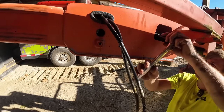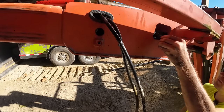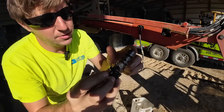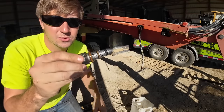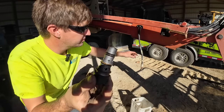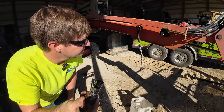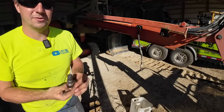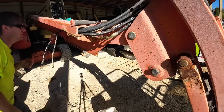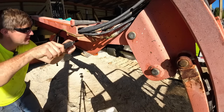Oh. Come loose, or is it something came loose? There we go. I was worried it was gonna be a whole bunch of different components on that check valve that was gonna drop and lose in the gravel, but that's what we got. As soon as we took it off, it's kind of trying to bleed itself out right now. So in theory, I think we can take the pry bar and try to collapse that cylinder now. Very nice, the hoses are sliding, everything's moving. Making me happy.